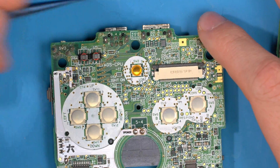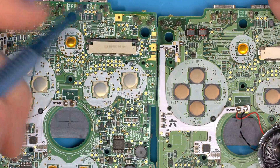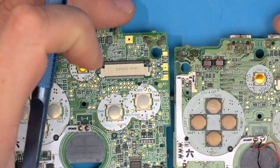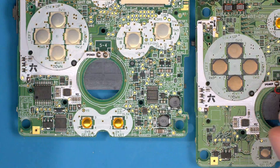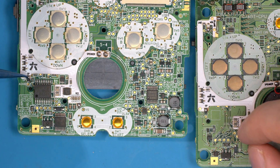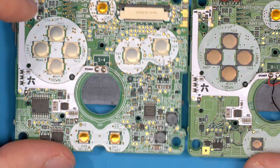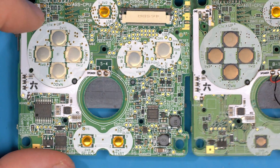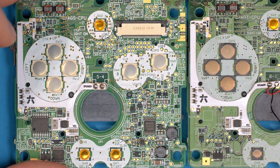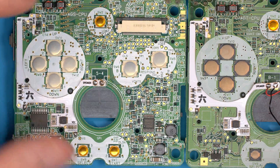You can in fact cut this off or tape over the P35 pad. When you have both SW and P35, you solder to only SW. This is controlling the headphone disconnect. Without this setup, if your amp doesn't have that, then when you insert headphones it's not going to disconnect the amp. The sound will stop because the Game Boy's amp will stop sending audio to the SP pad, but you'll still have your audio amplifier running and any background noise will go through the speaker.